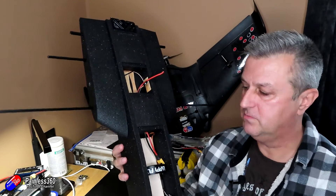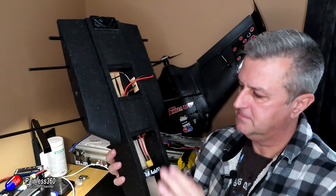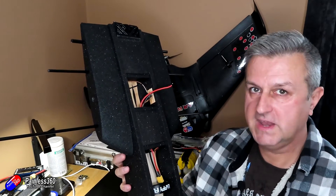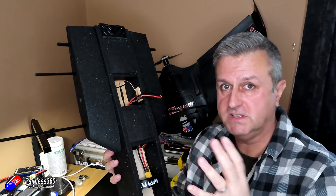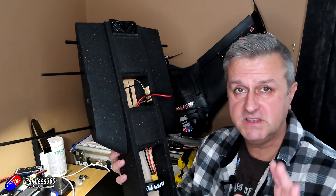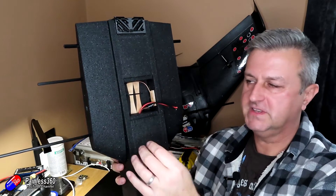There's only one other thing you've probably spotted — I've temporarily put in a power lead. This is going to have to go to the back of the flight controller, and that is probably the last bit of soldering I'm going to do: attach that and the ESC, then stick the flight controller down. Because I have these wooden slats on here, mounting the flight controller, video transmitter, and receiver in this bay is straightforward using double-sided foam tape. I try to get the foam tape designed for car number plates — it tends to be incredibly sticky.